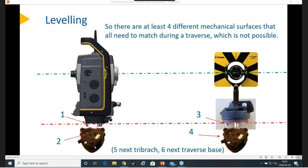Is manual aiming better than auto lock with a 360 prism? I would say manual and auto lock are equally good. But it's easier to stay focused using a tracker instead of trying to look through the telescope all day. So in the long term, it would be better with the tracker.